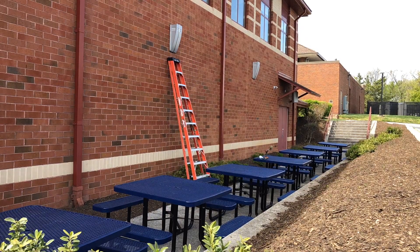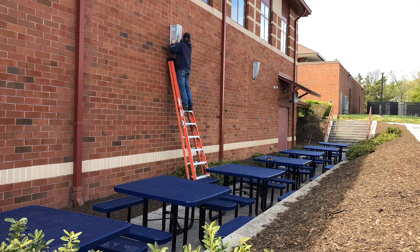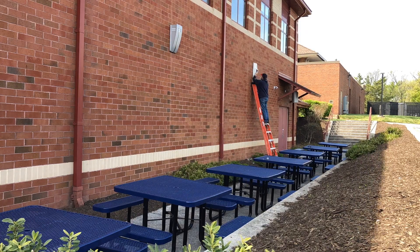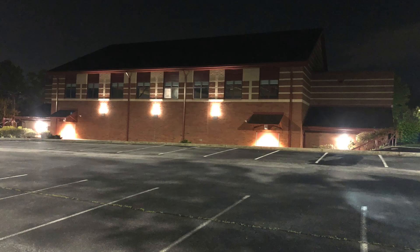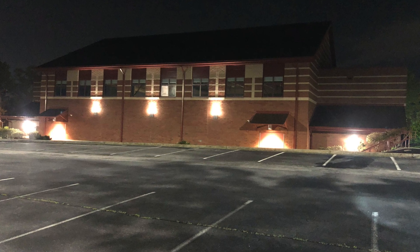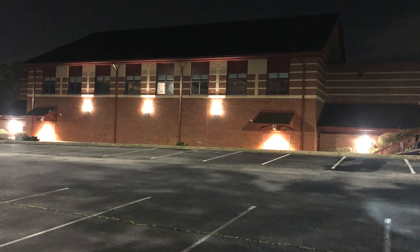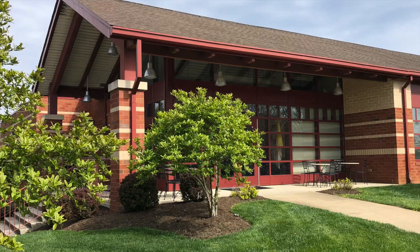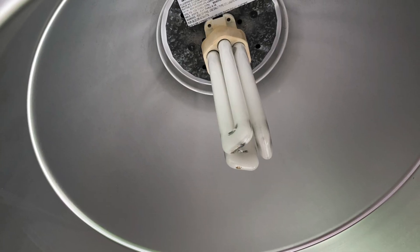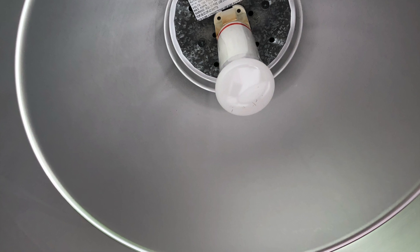The last two went quite a bit more quickly and we reduced the wattage from 70 down to nine watts — a huge savings if those are running all night long. It's really more decorative, not providing a whole lot of light on the ground, so you really don't need that higher wattage. Next I moved on to the pendant lights on the porch, which were not as high wattage, but still significant savings going from fluorescent to LED.